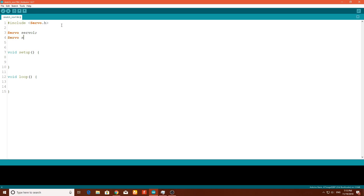For the second servo, do the same and name it servo2. Moving on, initialize the joystick X variable: write joyX equal to 0 with a semicolon. Then initialize joyY for the y-axis equal to 0 — these correspond to analog pins A1 and A0 connected on the breadboard. Now initialize the joystick variable values, and that's it for the declarations.